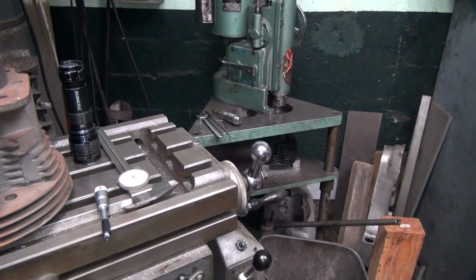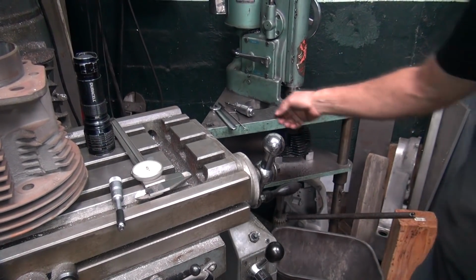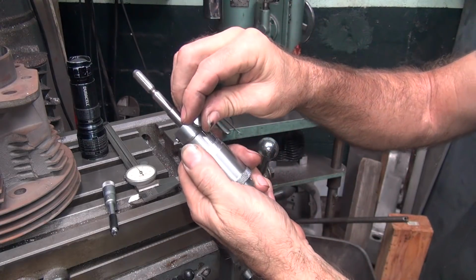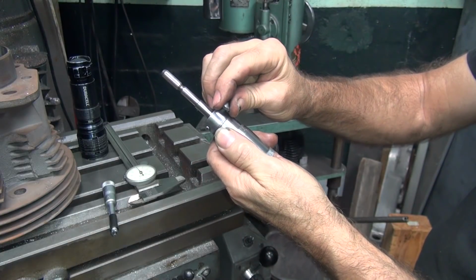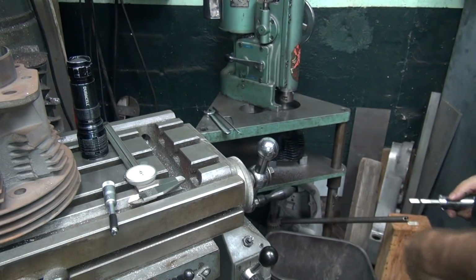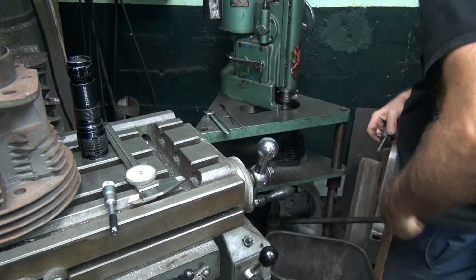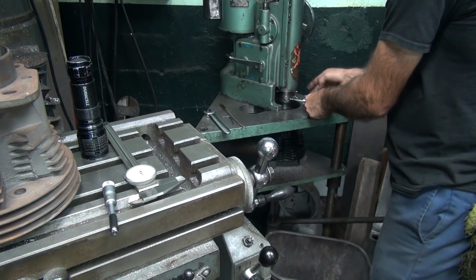And now we're cutting a bigger load than before, so we'll still cut undersized just to make sure we're not overdoing it. So we should be at 44 with no problem. I'm going to cut down an extra half lower than that just to make sure it's good to go. Don't want to cut too much. Already did that once. I don't want to do it again because now we're on the bigger piston. So it's a heavier chip load. So it's probably cut different.